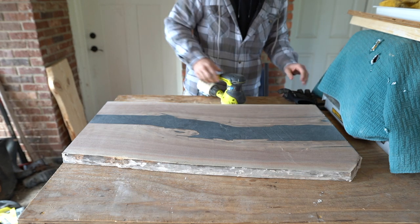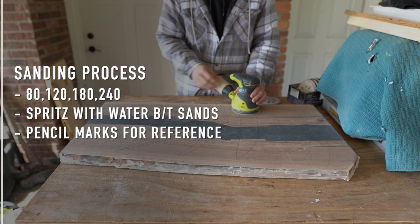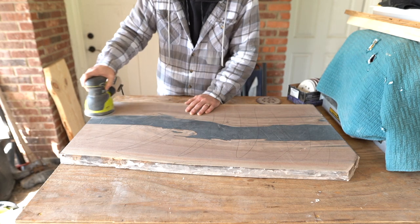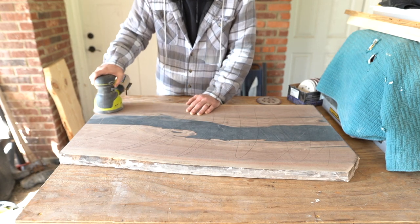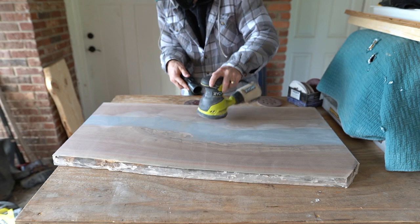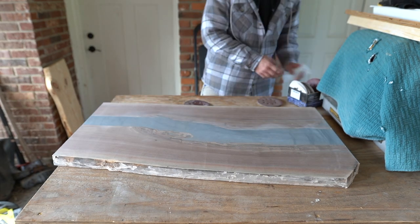This step is for the excess epoxy, not for the wood. Moving on to the sanding process: I'm going to start out with 80 grit, move up to 120, 180, and then finally 240, spritzing with a little bit of water in between each sand to raise the grain. I'll use a pencil to mark on the wood and epoxy for reference — to know how much I've taken off so that every bit of the surface is perfectly level, smooth, and uniform. I'll also use my shop vac to clean the orbital sander and the top of the surface, to remove as much of the fine microscopic dust particles as possible and ensure an even smooth finish between each sand.